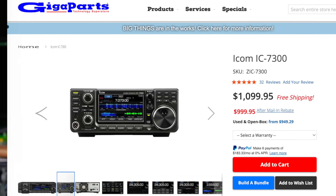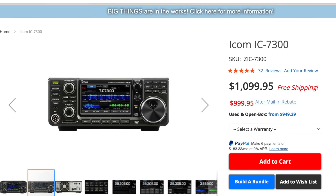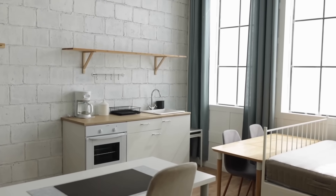Spoiler alert: this can get expensive. You will likely need a decent 100-watt base station radio with a good receiver — what we often call a front end — as well as the appropriate feed line and antennas. And those will need to be in both locations. So a child going to college living in a dorm likely is not going to work out very well in this situation — at least not something they can consistently just pick up and start talking to you back home.